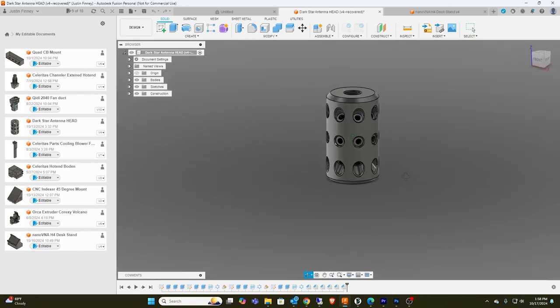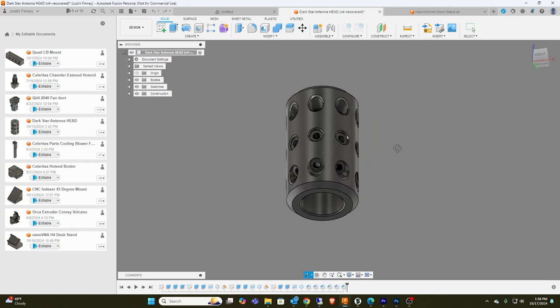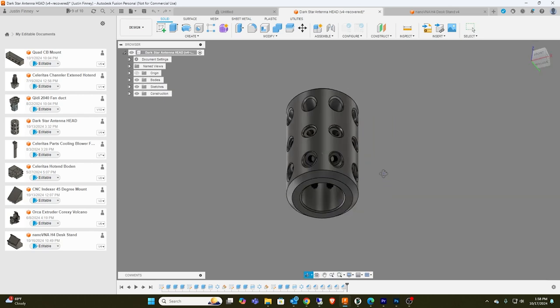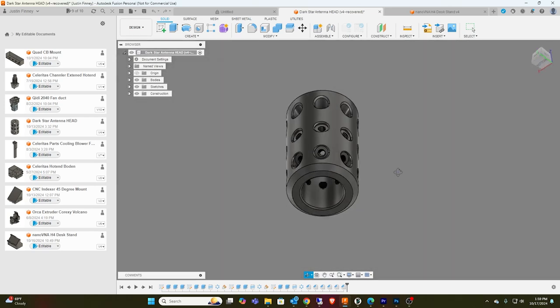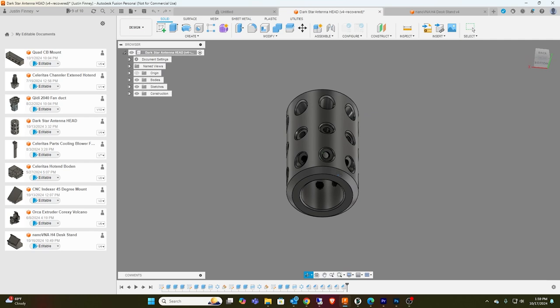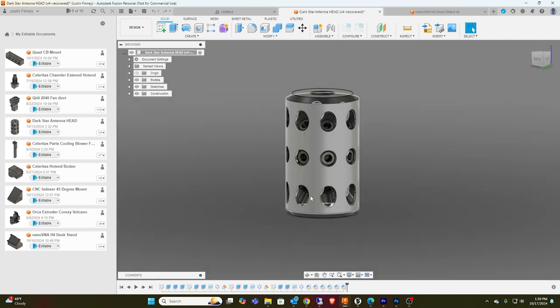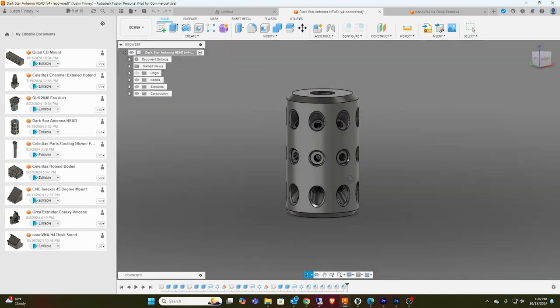All right, now I've got to go out and machine it. I'm going to do some of it with my manual lathe and maybe some with my CNC. I do have a fourth axis indexer, so I need to come up with a solution to tilt this thing at 45-degree angles. You have 45, 90, then 135, so there are a few different angles to cut in here.